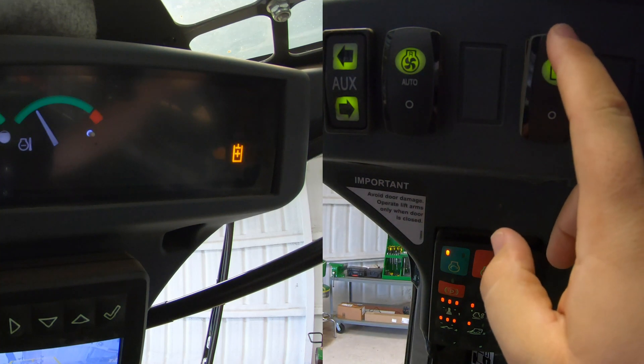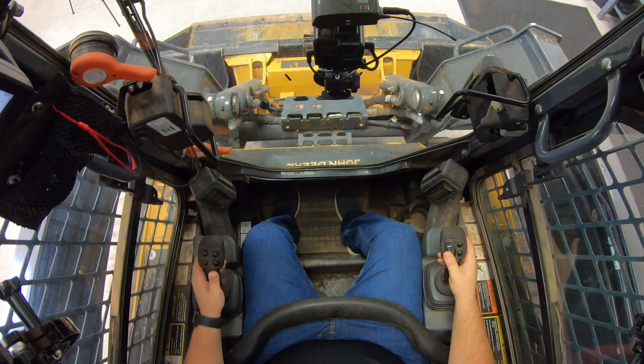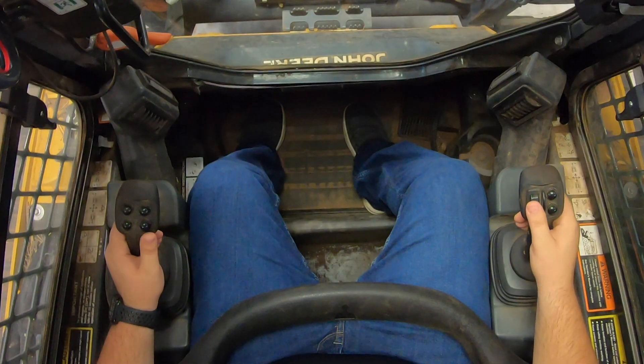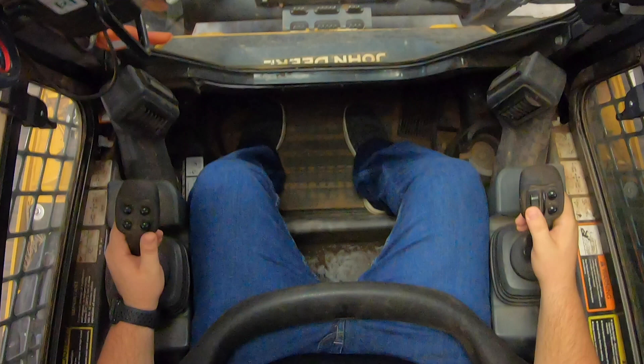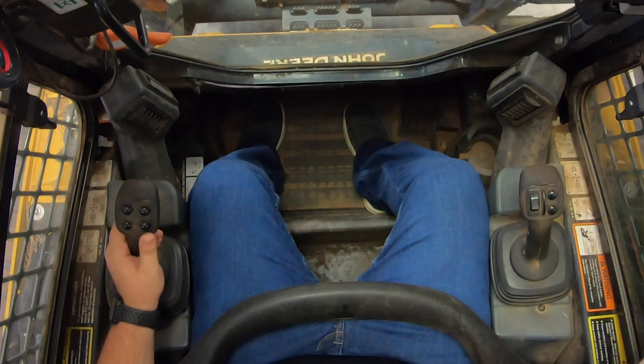Once for on, once again for off — very simple. Now as far as using the auxiliary hydraulics, some of the places where we might use these are going to be such things as grapple buckets that are just going to have that in and out motion. Basically we're sending hydraulic fluid to the unit to close that bucket and then bringing it back out to open up that bucket. For those things we are going to use this rocker switch here — if we want to send hydraulics, we push forward; if we want to take hydraulics back, we pull backward. And that is how we would run those hydraulics.